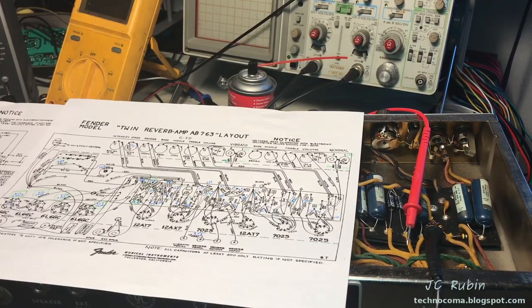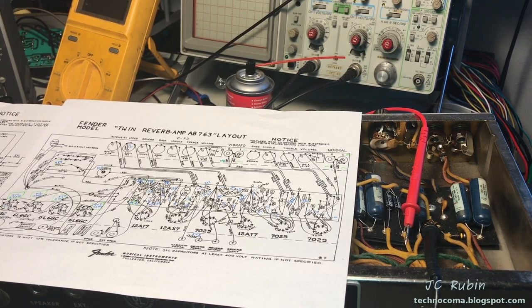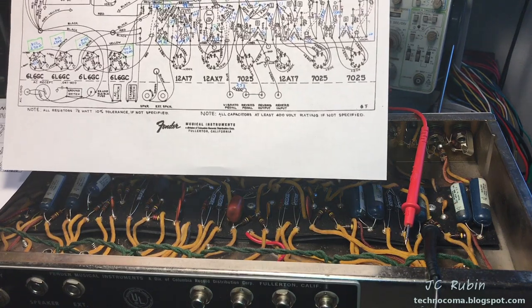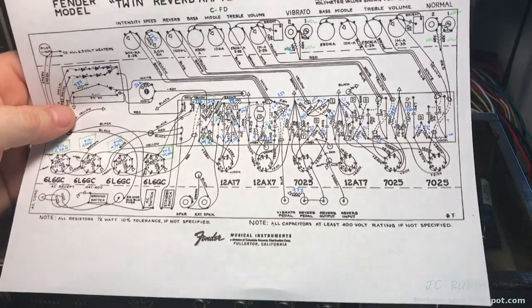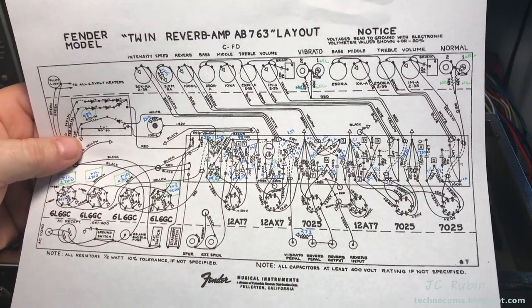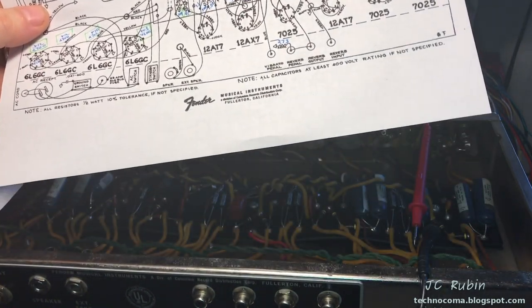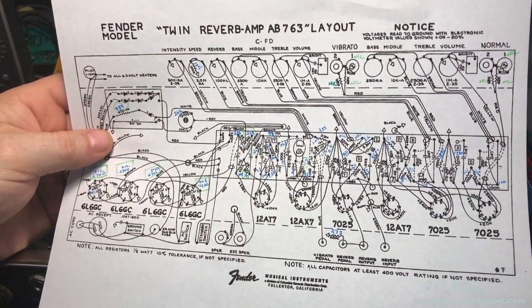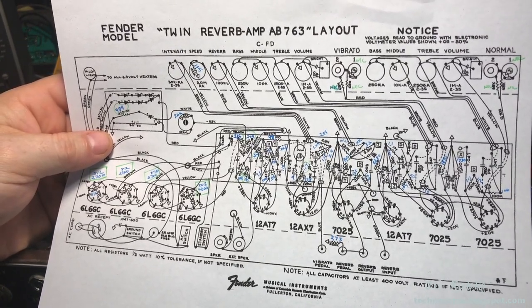The next thing I got into was capturing the values for all of the resistors in this unit, and it is not my favorite job in amplifier repair and restoration, admittedly, but necessary indeed. I just want to point out some observations post-test, and that is, resistors are hit and miss in amplifiers. This amplifier is in immaculate condition. Capacitors were perfect, save the electrolytics, obviously, came as no surprise, right? Resistors, not so wonderful. And these were all silver bands shown in here.